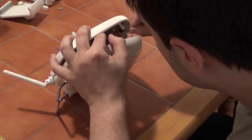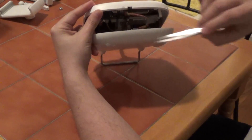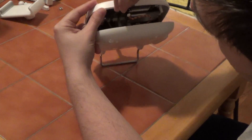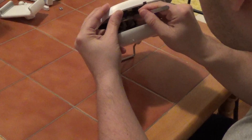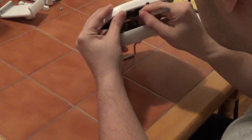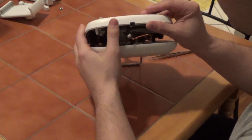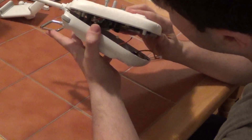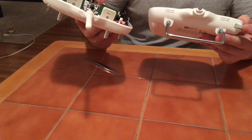Take your time when disconnecting these cables so that you don't mess up any of the connections. Here I am taking the battery connection — I already took the charging connection. Lastly, there is a cable all the way in the middle that I am trying to take apart. That one came out a little bit harder but eventually I got it out. After removing the last cable, jiggle the bottom part left and right and it will come out, and you can separate the top and bottom.